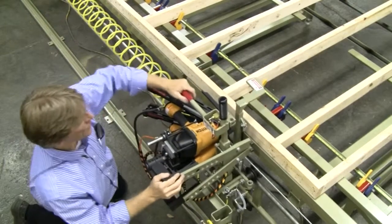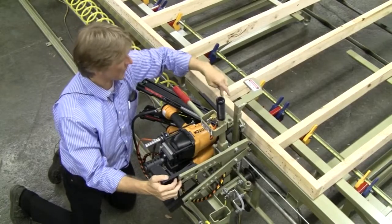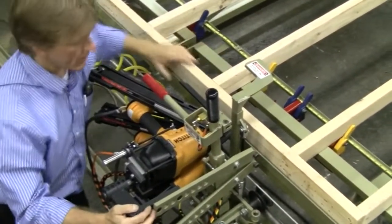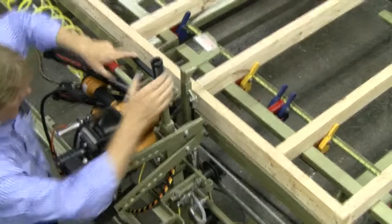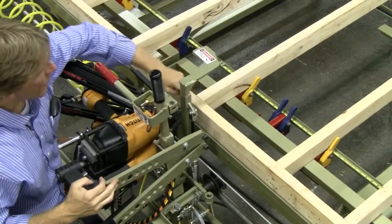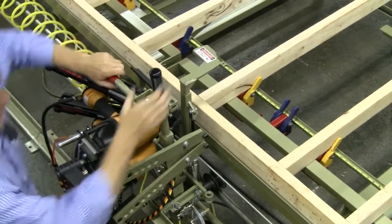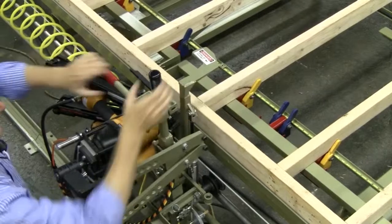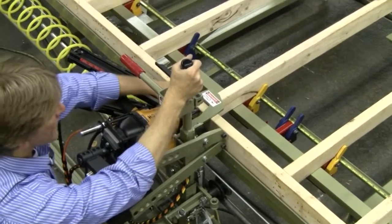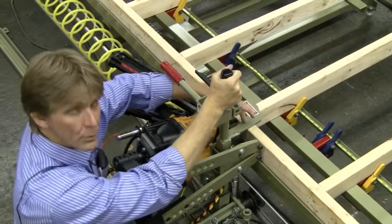The manual dolly is a real slick system. You've got a down clamp pad that actually comes in and pushes down against the plate and the stud. I'm going to show you that here real quick. Ideally, what you're trying to do is take the nose of the tool, eyeball it, and line it up against the stud. Manually, you're going to take this, push it all the way in — the safety is made, the down clamp comes down, and we're actually flushing the stud and the plate.